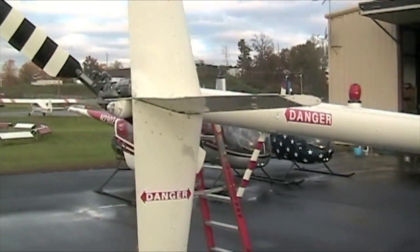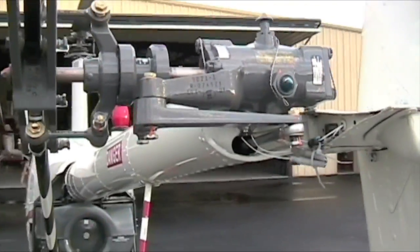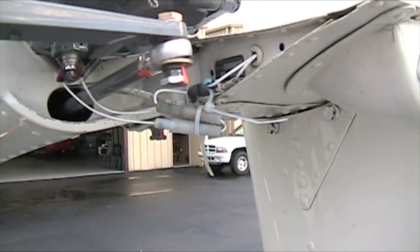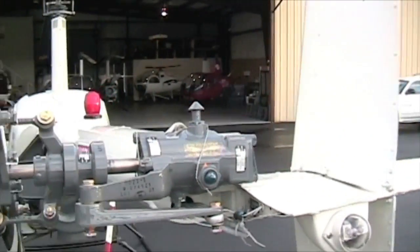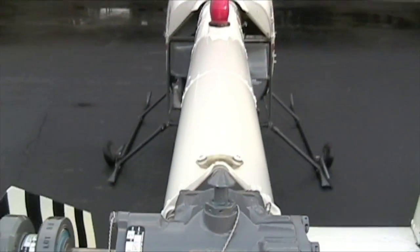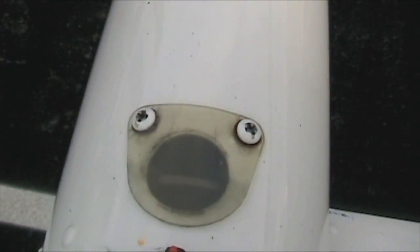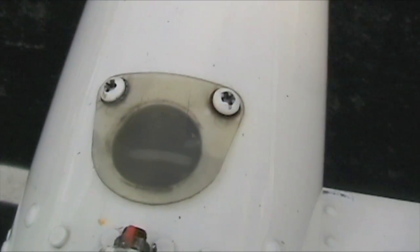Different aircraft, but we're going to continue this pre-flight back at the tail. This aircraft is just out of overhaul — it's not quite done, so little stuff like zip ties aren't completely tight right now. This is your tail rotor gearbox assembly. You can see the shaft comes out of the gearbox down the tail boom. There's an inspection sight glass right here, and you can see there are four bolts that attach the drive shaft to the tail rotor gearbox — check all the way around.